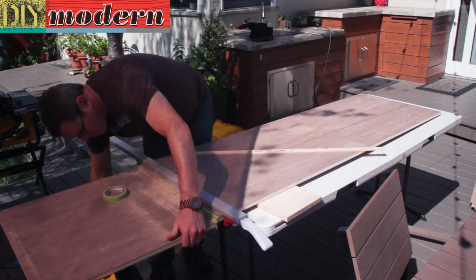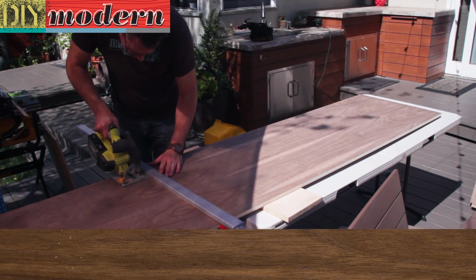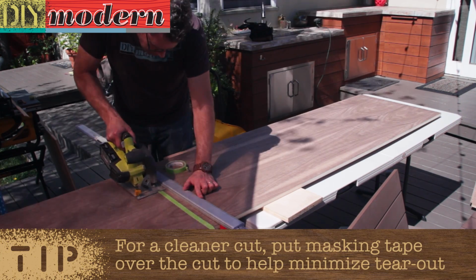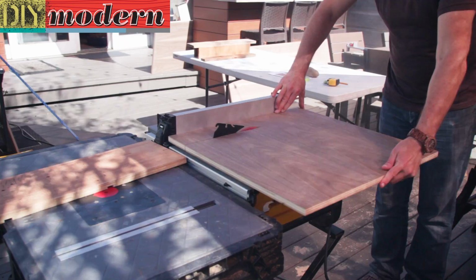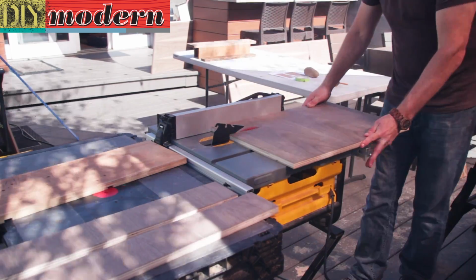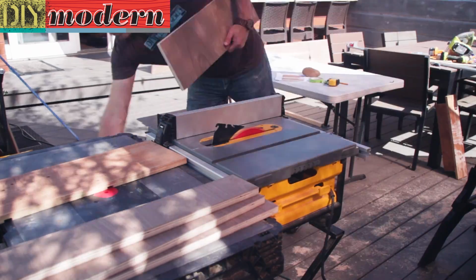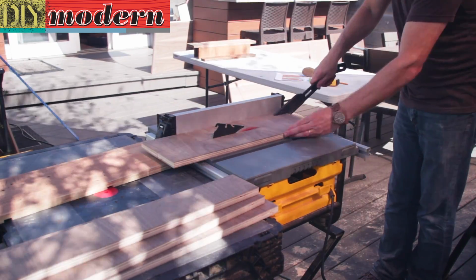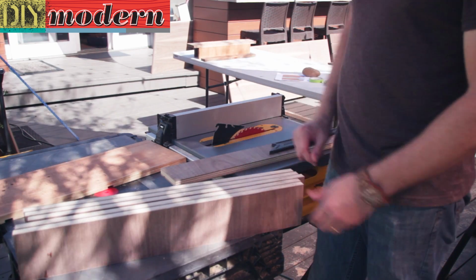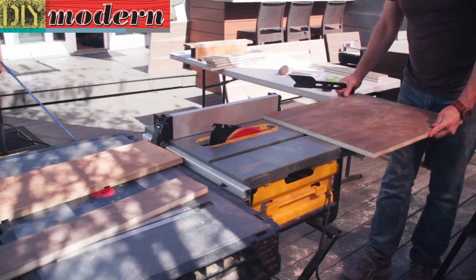I began by cutting 2 of the sheets at 72 inches for the top and bottom of the main desk. This main desk is 72 inches long by 24 inches deep. The sides are all 4 inches tall, and I cut these pieces on the table saw. Basically, the desktop is a big box with 3 openings. The center section is open and the side sections are enclosed.